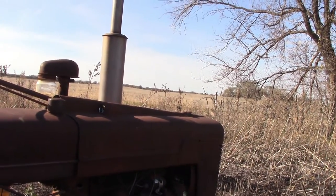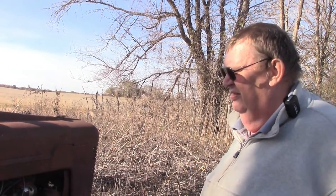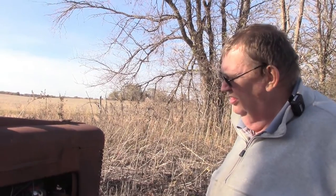Most of the time when we primed, the primer was mixed with the paint. The big thing I worried about was humidity - on a real wet day we put a heater in with the paint. On a real dry day we did the opposite. In winter it wasn't too bad because cold usually means dry. On a wet snowy day we needed a heater, and on a real cold day you could add some accelerant to help it dry a little quicker.